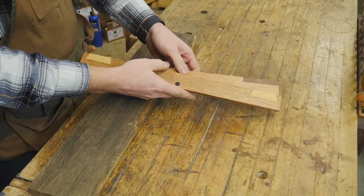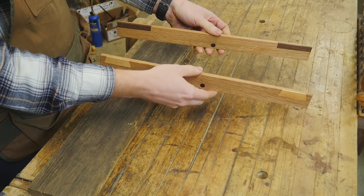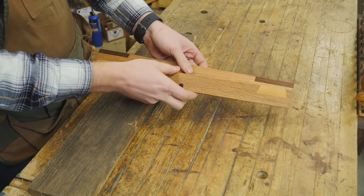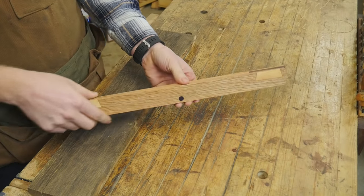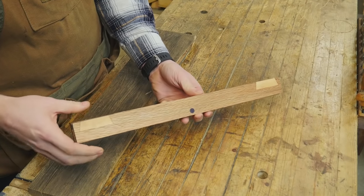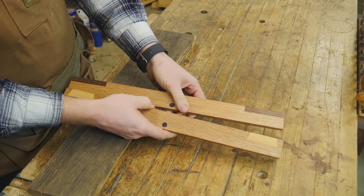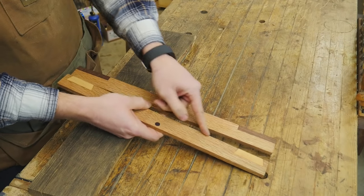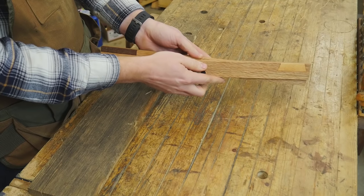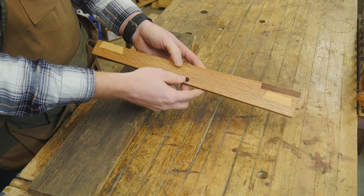Basically what you can do is set these two boards on a plank, and as the plank twists, you will see one goes up and the other one comes down, and you can actually see the difference. You can do this with basically any two sticks you want — just scraps lying around — as long as they are the same thickness here and the same thickness here. Most people end up putting a darker wood on the back of one and a lighter wood on the front of the other, so you get a contrast as you look down. You'll see the black sticking up until it goes parallel and goes back down — it allows you to see a little bit better.